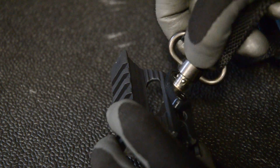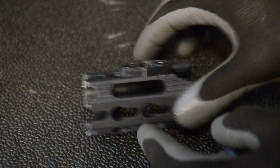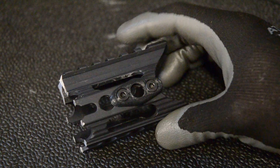This version you see here is printed in polycarbonate, and you can see this thing goes right in and out. I've also printed this in ABS and PLA and some other co-polymers. For ABS, the pull-out strength — these locking balls here on the QD sling will pull out of ABS at about 40 to 45 pounds. And then for PLA, it was around 80 pounds.